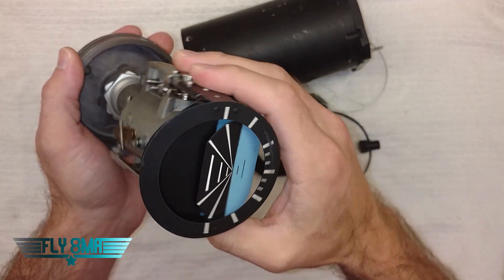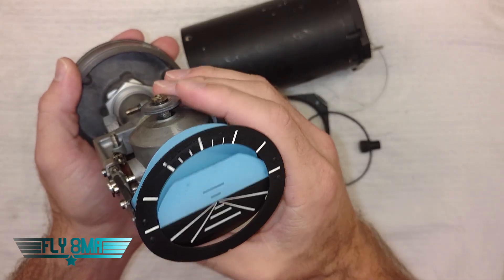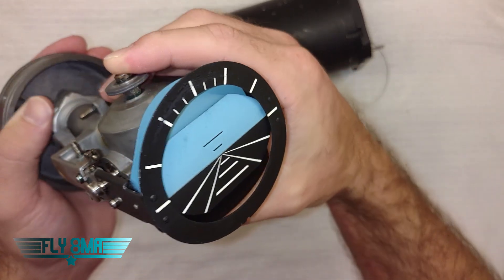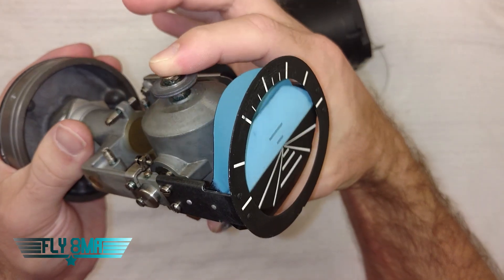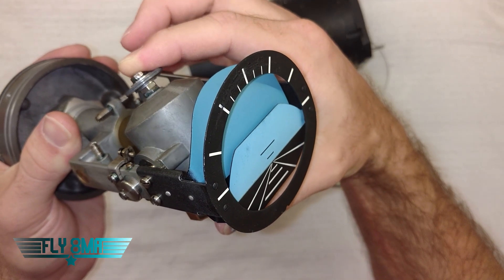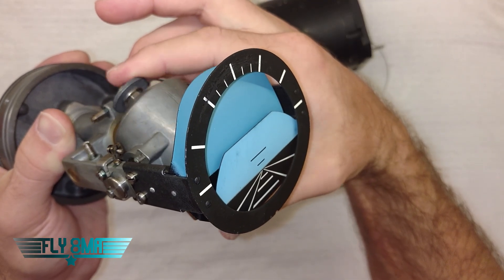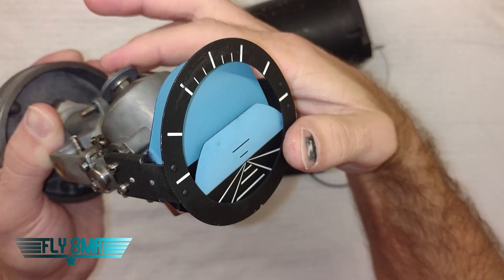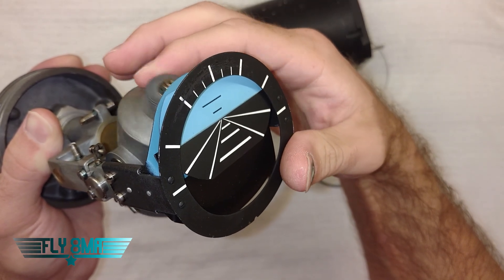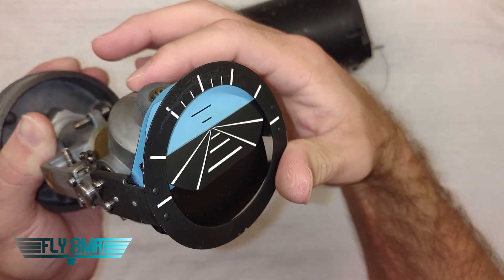The way this instrument is set up it can actually roll a full 360 degrees. Then we have a limited pitch component — if I tilt this gyro that I'm holding with my right hand, I get to a max of about 20 degrees nose down, and if I tilt it even more you don't see the actual face of the instrument moving at all. So although the instrument knows you're tilting more than 20 degrees, it limits the indication to about 20 degrees or so.